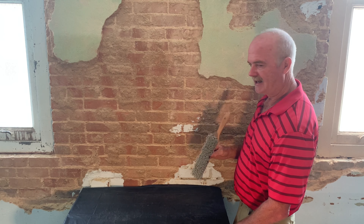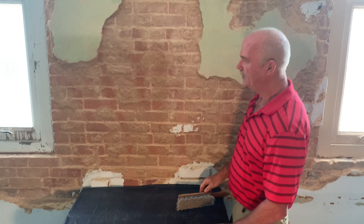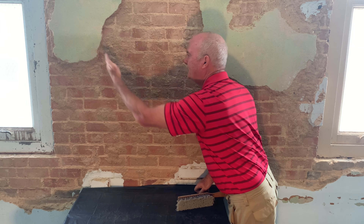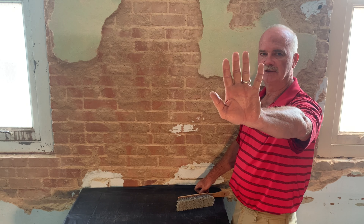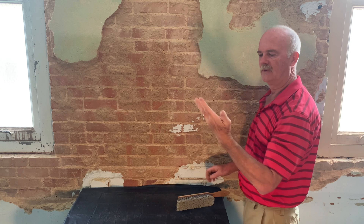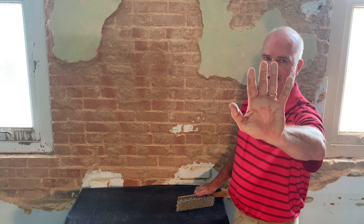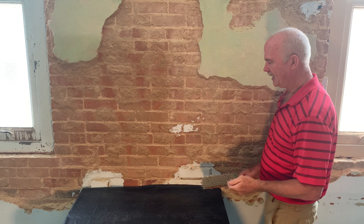We're going to brush on both sides to see what we gained on the dusting. But first, I'll do this — this side was treated, and as you can see, there's virtually no dust on my fingers. The plaster on the untreated side, as you can see, we're still picking up a lot of dust. So on the plaster part, we definitely gained ground.